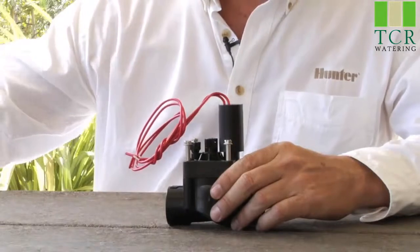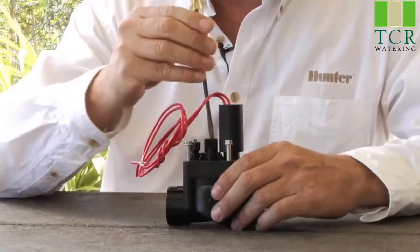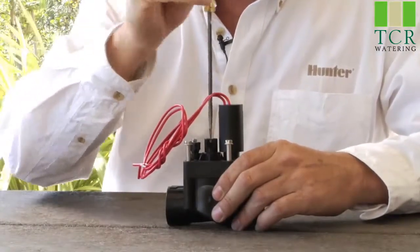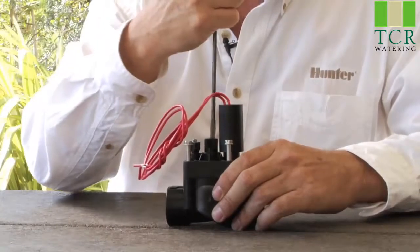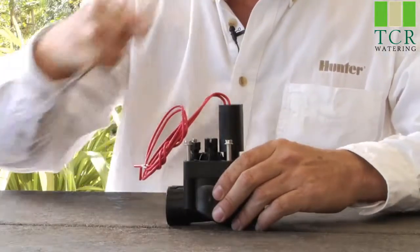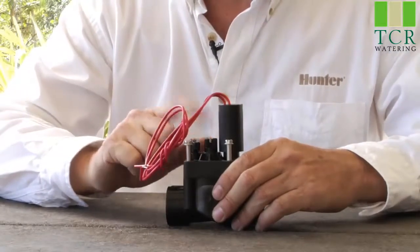Secondly, is the flow control open? Here in the center we have the flow control. I'm going to take this screwdriver and turn it clockwise, which is the closing position. If you open it back up, you can open the flow control all the way to the top to where it stops. Don't overdo it — they are plastic parts. Then simply turn it back about a half a turn. If the flow control is all the way counterclockwise, you know it is wide open, so that wouldn't be a cause either.